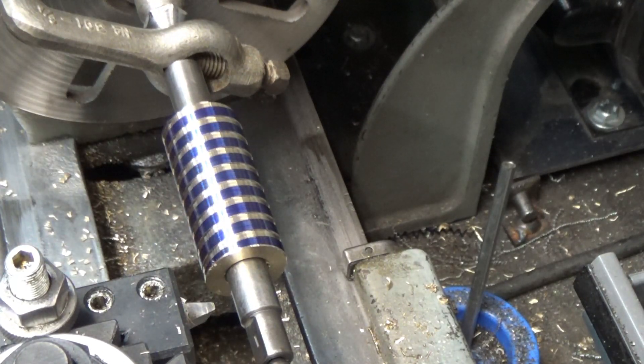There's a lot of tool pressure on this, so what I'm doing is taking very light cuts and doing a scratch pass about every other cut. This is going to take a while, so I'll bring you back when we're a little bit closer to finished.